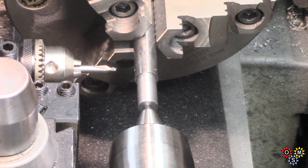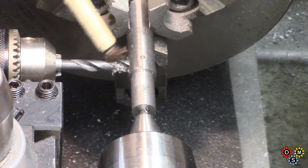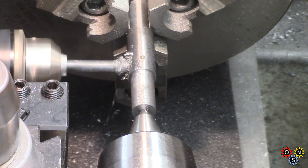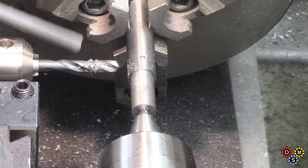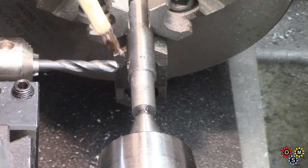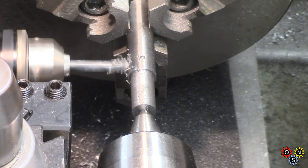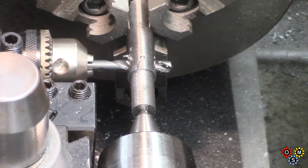Now I've got to go around 90 degrees. I'm just doing the last bit of the 7/32 hole — this is making the whole thing look so small. Taking it easy on this; this is actually O1 material. Trying to keep plenty of lube on it. Right, we're through.